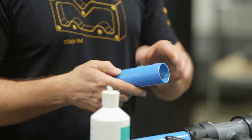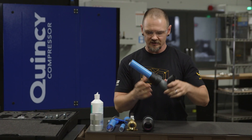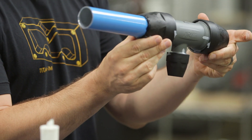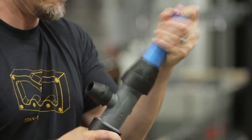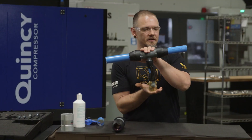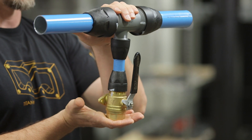So we'll put a little gel on there, kind of go around the pipe, and it just slides on — just like such. You can see there's our mark right there. That's how you know the pipe went on all the way. Good to go to your next fitting. There's our fixture — one-and-a-half-inch piping coming in reduced to one inch into a ball valve. Ready to go.